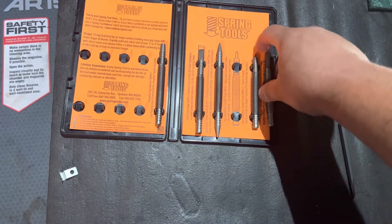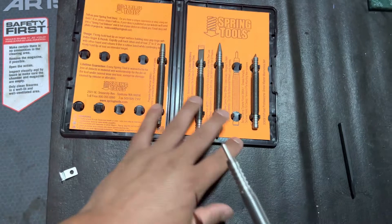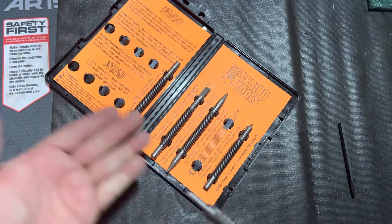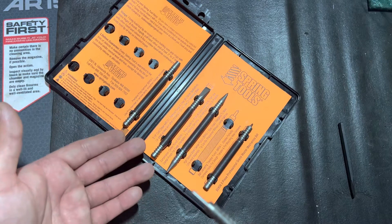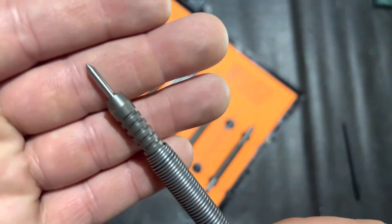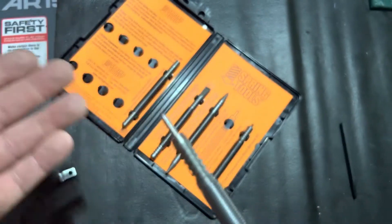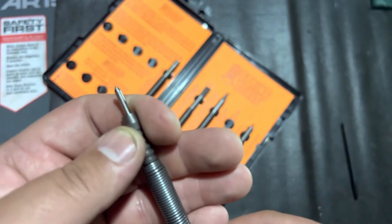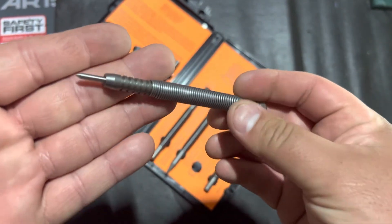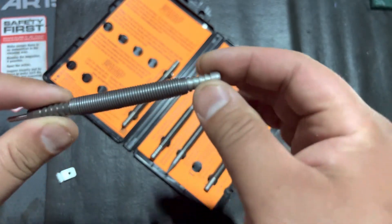This one right here is your normal center punch, but it's rated for harder steel. It's high-speed steel — the center points are specially designed to mark ultra-hard materials, and the tip can be sharpened without losing hardness. So if you've got some harder metal — stainless steel or something — that you're trying to drill into, your standard center punch is going to flatten the tip, but this one is what you'd want to use. And they make it long enough that even with repeated sharpening, it'll last you a pretty good amount of time.